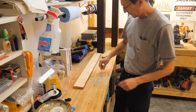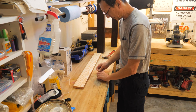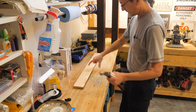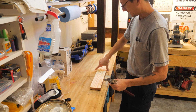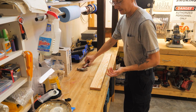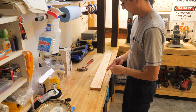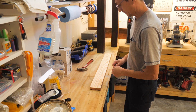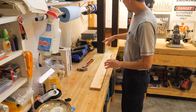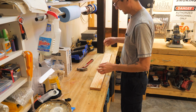So I've let all the stained pieces set overnight to dry, which they have. And today's agenda was to set up the sprayer outside and start spraying poly. But it's raining and really humid, and I don't think the sprayer would work real well. So I'm going to brush on 2 coats of poly for a base sealing coat.